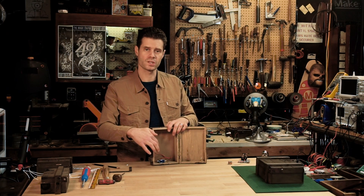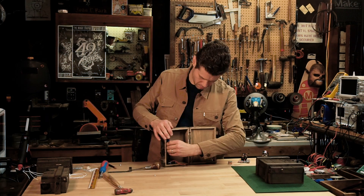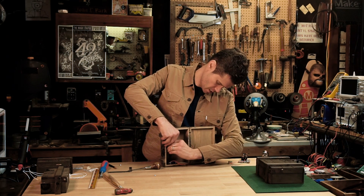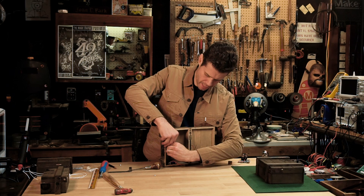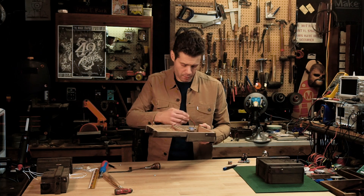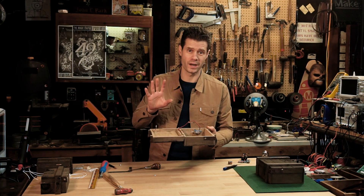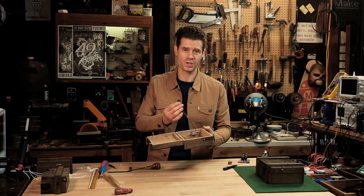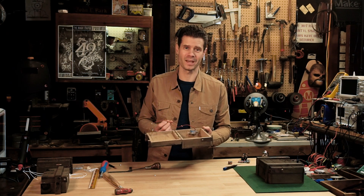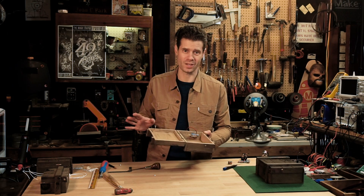I'm going to mount the solenoid to the side of the box with these little mounting ears, then fine-tune the hook until it works just right. I'll tighten one screw fairly tight so I can test out some angles. The solenoid, if tipped up just a little bit, may engage the hook better. Important warning: don't close the box with the wires tucked in, because if the hook latches, you'll have a hard time getting back in. Leave the wires outside so you can use power to slide the solenoid if necessary.